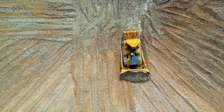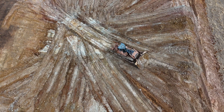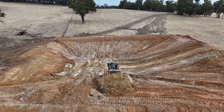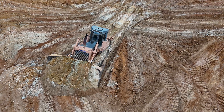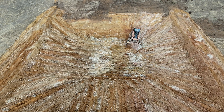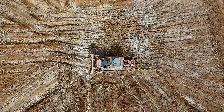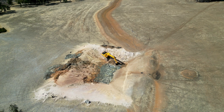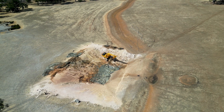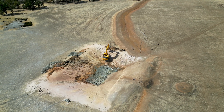When we're talking about dam sealing, can you tell me a little bit about that? You've already established the clay quality when you drill it. Then it's basically just taking floors — the machines we've got, we usually take about a metre at a time off the floor — and lining the walls in layers. If the clay is moist, it'll compact pretty well. Generally, the further you move down, usually the better the clay is. There's also that ten-foot layering of clay to consider.